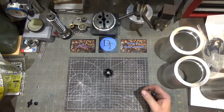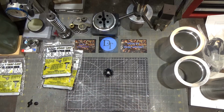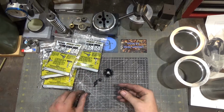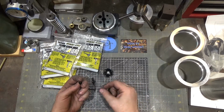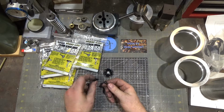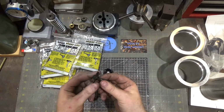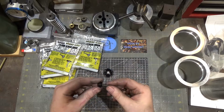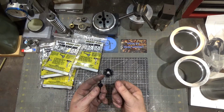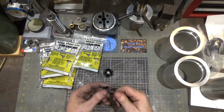But there's another solution, these guys, and they come in a huge variety of sizes and shapes. What they are is thumb screws and knobs that fit on top of cap screws. So this one is designed for 1/4-inch cap screws, and all you do is just press fit this on, whatever screw size you need, and you've got an instant knob. And I don't want to push this on because once it's on, it deforms. It's an interference fit, and so it is really on there.